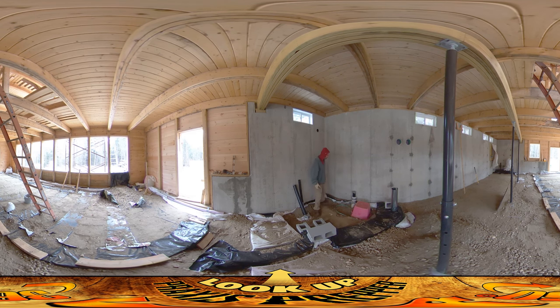They said that what they had planned on was that the floor level was not going to be where it's labeled 'floor,' which is clearly where this thing was aligned with. They were thinking the floor line wasn't going to be here but down by the footing. This is an unconventional house — we've got a lot of fill and mass here bringing up the floor level — but even in a conventional house you wouldn't put the floor right on the footing; the floor always goes at least a little bit over the footing. So I don't know what their real story is, but they screwed this stuff up.